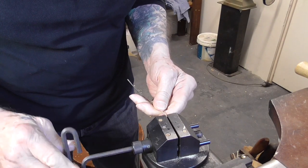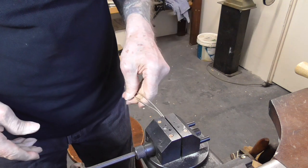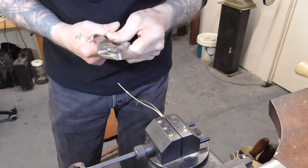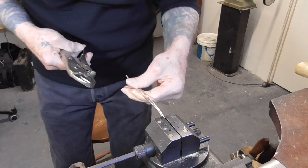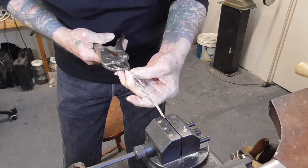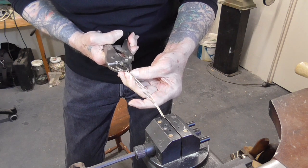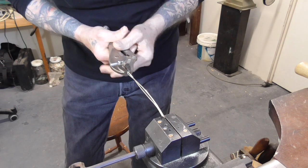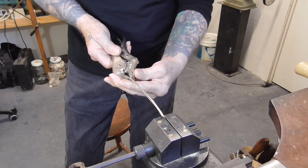So I'm just going to clamp a couple of millimeters, and then I'm going to use my vice grips to do the same thing. Now I'm right-handed, so I'm going to do a right-handed twist on this. Make sure that you get both of the wires nicely clamped, and once again only damage a couple of millimeters on the end, so you don't lose a long section of wire.